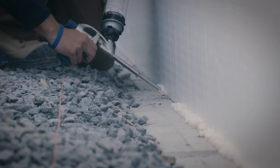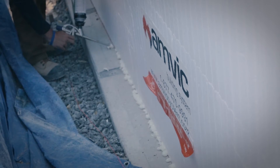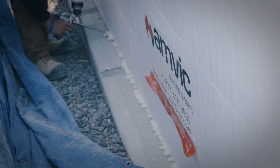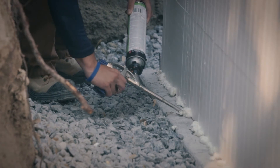Use low expansion spray foam adhesive every 6 to 12 inches to secure the forms to the footing or SOG. Use a continuous bead of foam if you had cut the interlock off the bottom of the first course of blocks. When foaming under large low spots, secure the entire area. Allow the adhesive to set for 30 to 60 minutes.